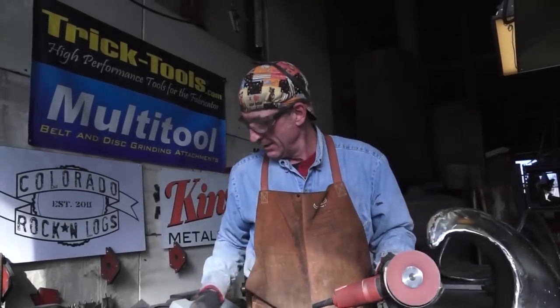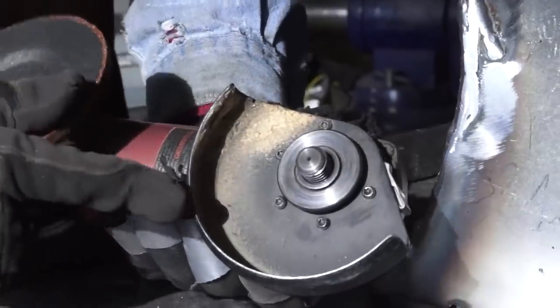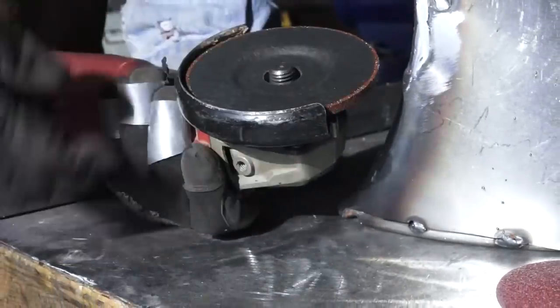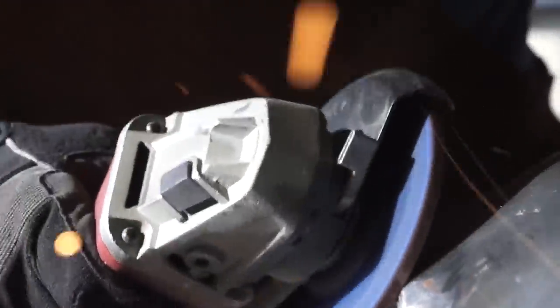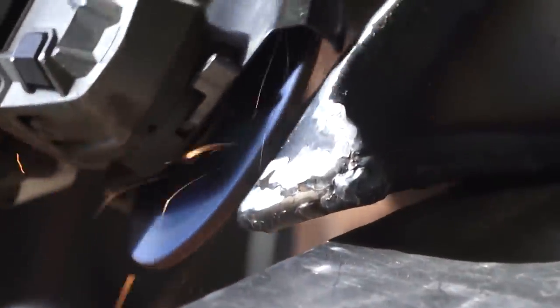So that's one option. You can also use these basic grinding wheels — I'll show you how this works. And remember, this guard is there for your safety. As you grind, position your piece to reveal the shadow line cast by the weld. Grind your weld flush, being careful not to cut into each other.